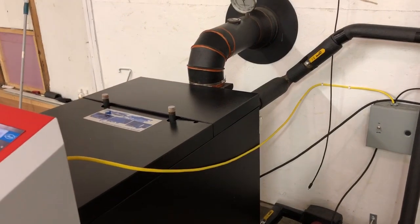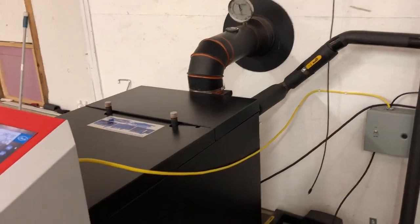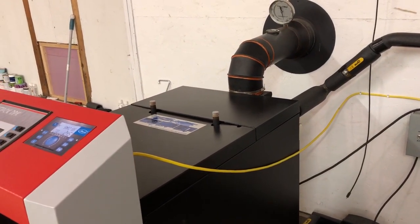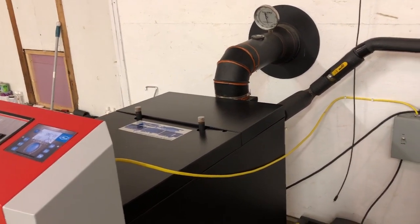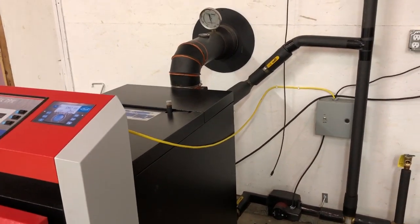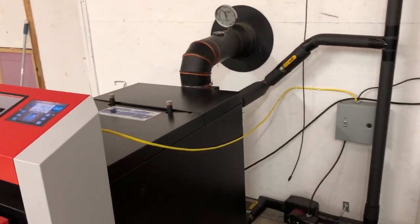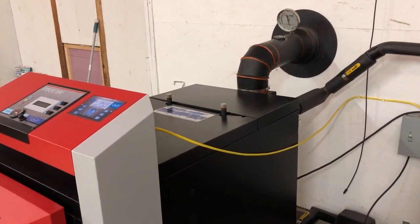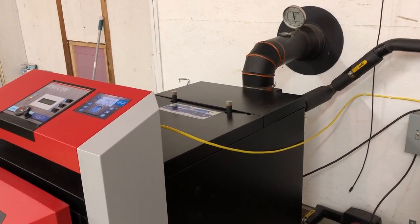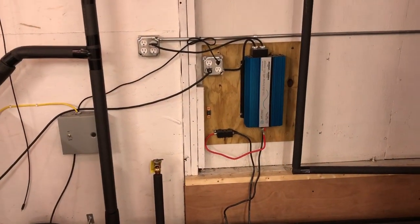Another method for handling an overheat situation would be a heat dissipation loop set up above the boiler, so it would gravity-feed the heat upward without any pump or power. However, I'd rather not go that route because you need quite a bit of tube and fin above the boiler to dissipate enough heat correctly. So I'm going to use the domestic cold water setup that the Europeans use. Between that and the battery backup, I feel we should be covered pretty well.